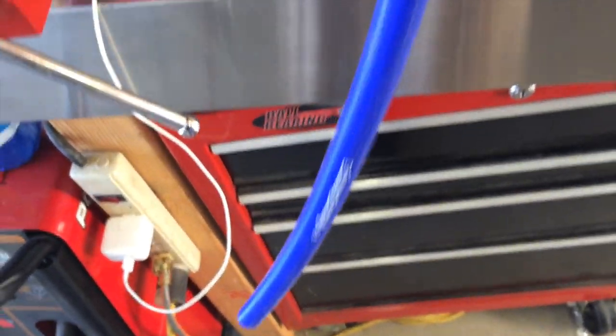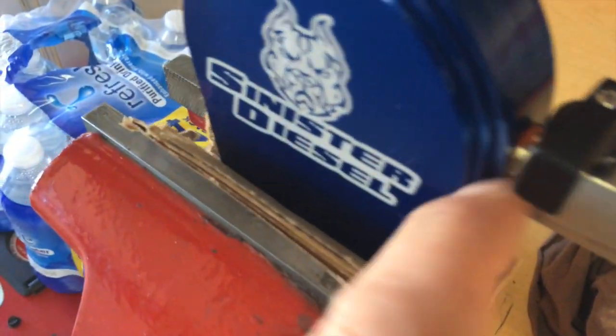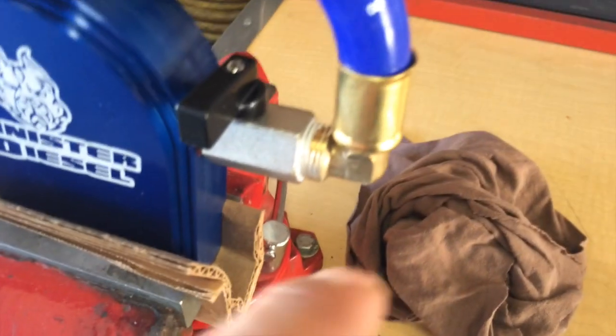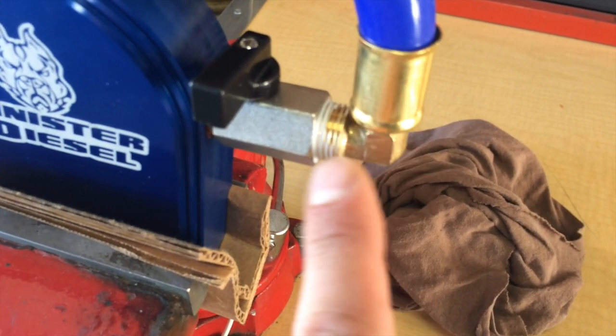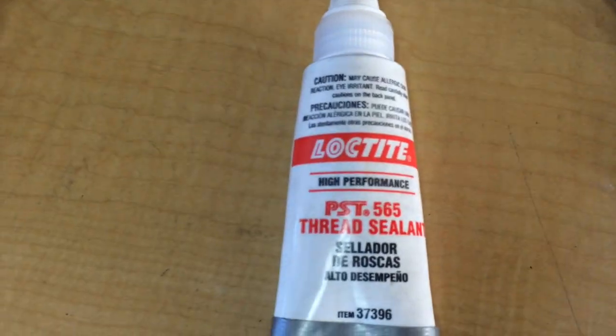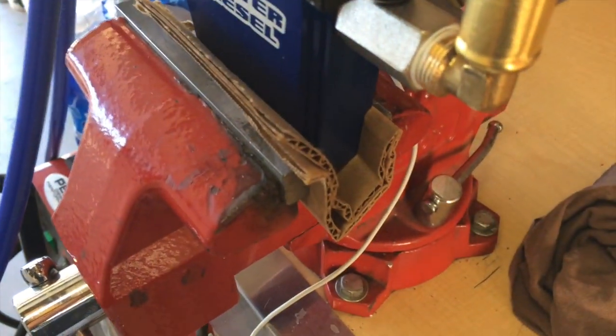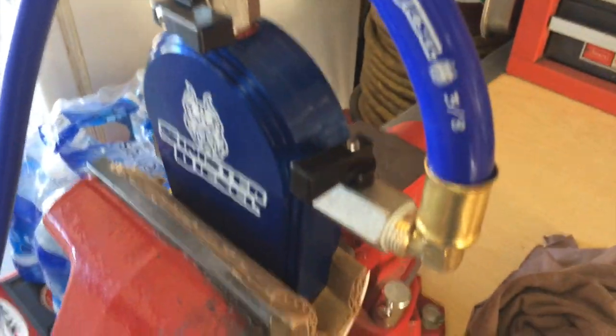Off the end you'll get the regular one with the straight fitting - that's off the cylinder head. The shutoffs already had some sealant on them - that kind of orange factory sealant - so those are good to go. On the brass fittings on the end of the hose, they tell you to wrap Teflon tape around it. I personally don't like to use Teflon tape - I use this Loctite brand stuff, PST-565. I use it on everything: fuel lines, any type of pipe thread where you need a sealant.